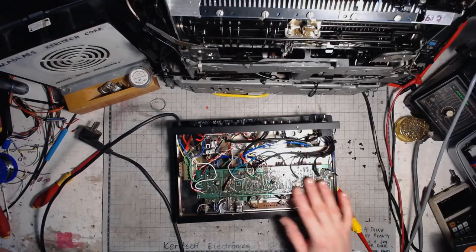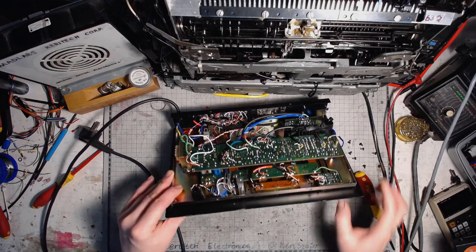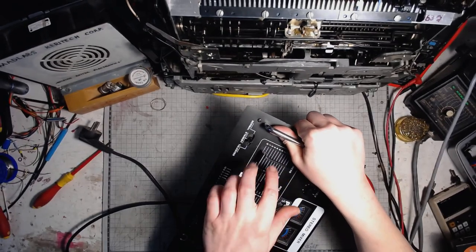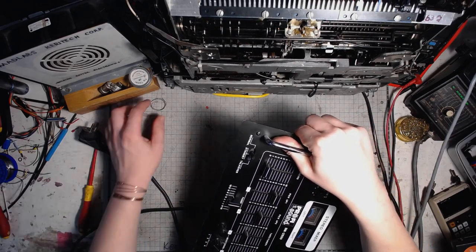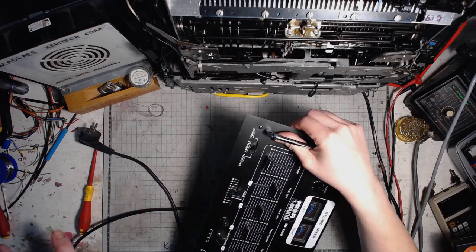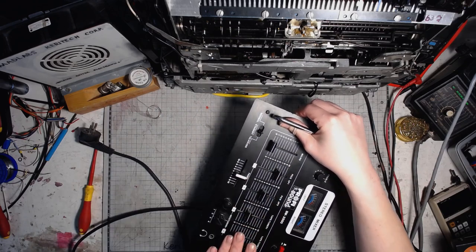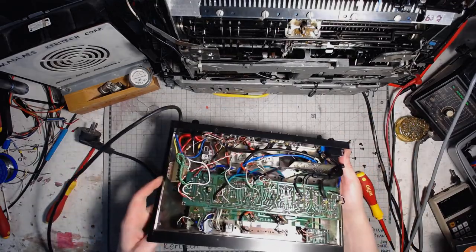This is the main circuit board on this one. The fader board, this is the crossfader. The microphone function switch switches between normal, that is a microphone input mixed into the signal without attenuating all the remaining signals. The standby is the microphone off, just in case you need to mute it quickly. And talk over fades all the line and phono inputs, leaving the microphone input louder than the rest.